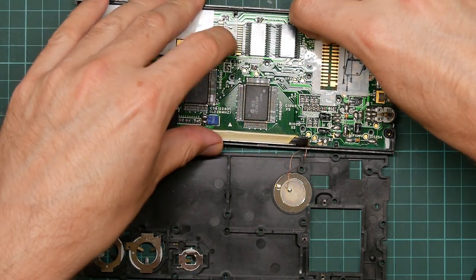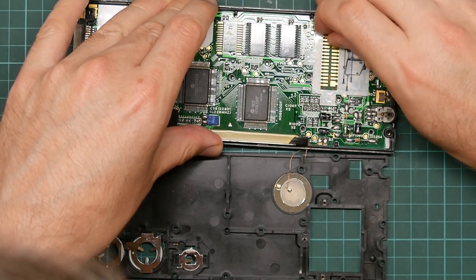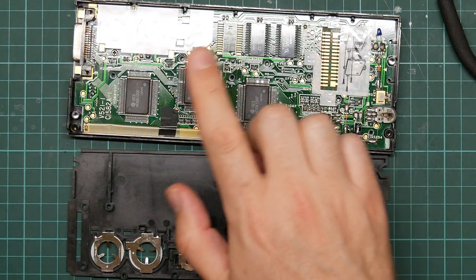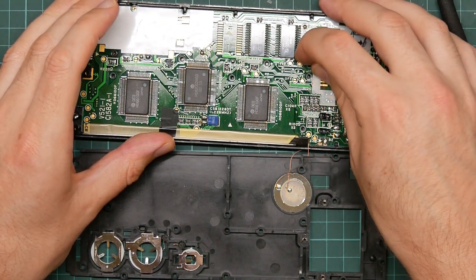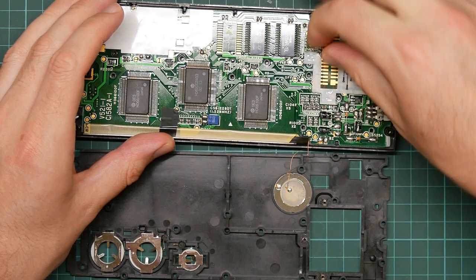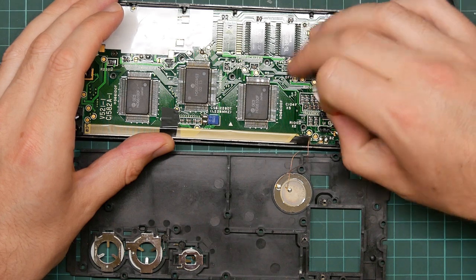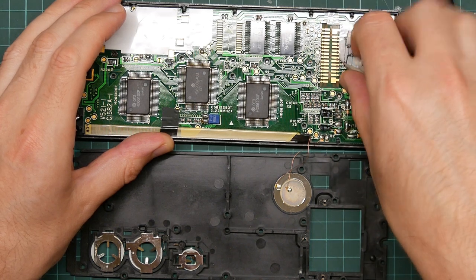And these chips are well understood, so you can identify what the various pads do from the datasheet. The actual ROM containing the code is built into the CPU, so it's completely inaccessible. What I'm hoping to do is, assuming the CPU, when it's doing a ROM access, still has the address and data lines hooked up, which seems pretty plausible for a simple processor, then I should be able to watch the chip select lines and the data lines and the address lines.